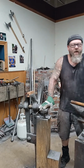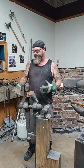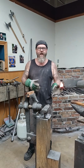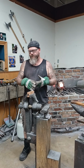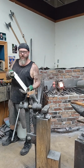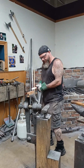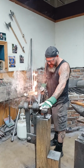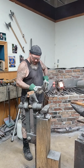They put, what metals do you work with? Right now, this blade is 1080 high carbon. On the low end, we generally will work with like 1075. From there, we also do Sanmai, we do Damascus, so we do meteorite, we do wrought iron, we do a lot of stuff like that. But as far as blade steels, a lot of times 1080, 1085, 1095, 52100 on occasion, 5160, 9260, 8670. One of my favorites now is 80CrV2. Multiple types of Damascus from repurposed materials and also from really weird stuff, from all new stock. So 15N20 usually for the contrast, unless I'm doing a meteorite, and in that case, nickel iron meteorite. We do copper at times. We'll do copper plates.